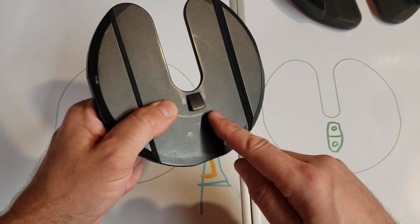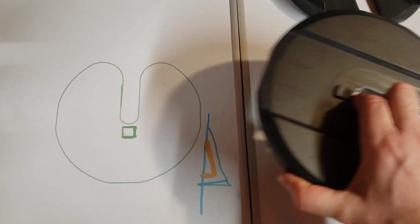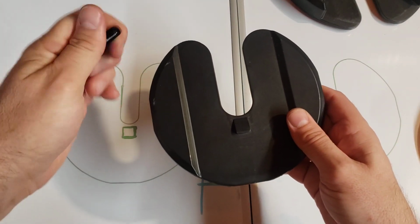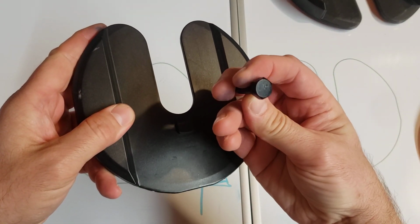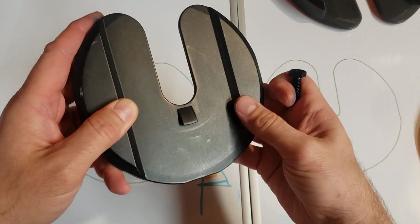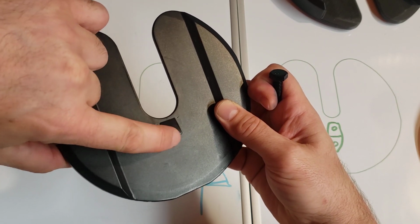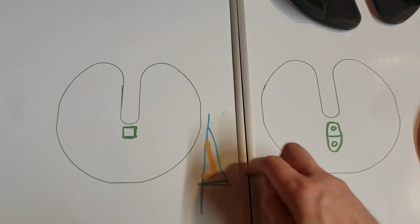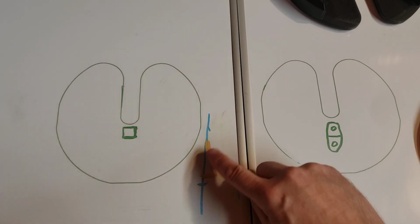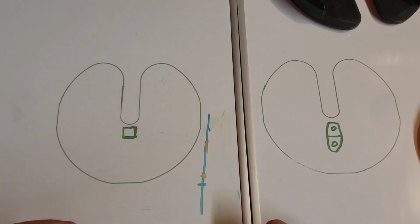These things can get extremely expensive, especially when you start getting up into these big plates. They could be $40 for a plate. So how can you salvage it? What we had talked about was using a bolt to replace the tab. How? Well, first, he took off his cover. He ground off this plastic cover completely so that the underlying steel tab was exposed. Then he ground off the steel tab until it was flat.